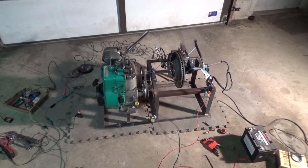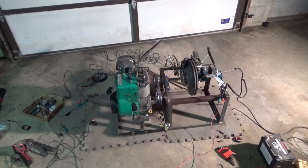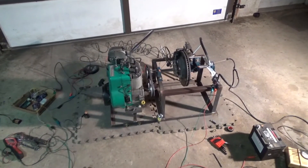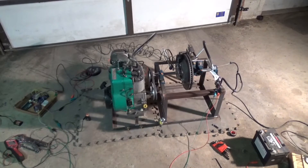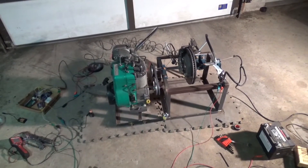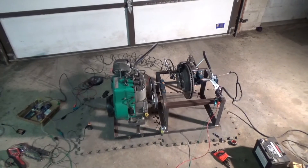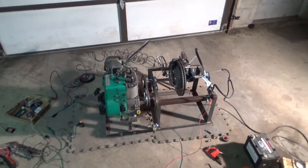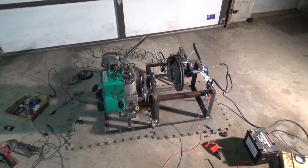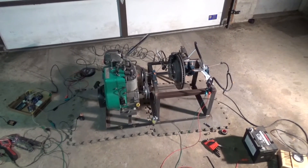I had a successful run tonight. The upcoming video is going to be of the run, and the next video after that is going to feature automated testing. I'm very happy with the results right now — everything worked as planned. Once I get the automated testing underway so that it does the brake apply automatically and it's not me manually varying the load with the potentiometer, it's going to be a fully repeatable setup, which is what you want for a dyno.